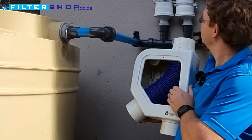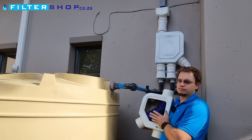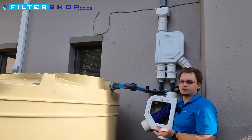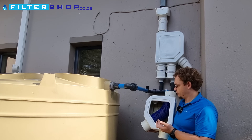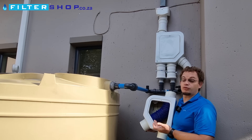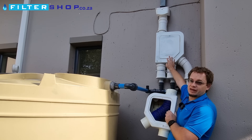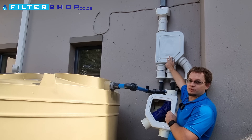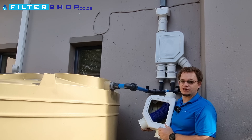The nice thing is on the Mini here, you filter to 136 micron, which is typically what you would get at a sort of irrigation shop disk filter level — which is very good for a product going before the tank.